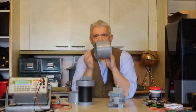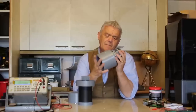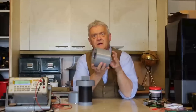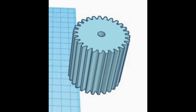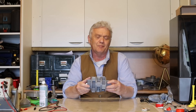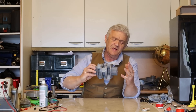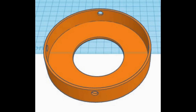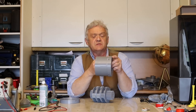The other thing we've got is the actual ring gear itself — again these are available in that file. I've done this for three of them and those three just slot in there like that. Now if I turn that I'll get 27 times the output. I've also created this large sun gear, and here it is on our gear train. The bolt goes all the way through so that's one lump, and that's because I want both an input and an output — if I input here it outputs here, but equally if I input here it will output here — so we can have it universally. I've also created this cap that goes on to the main body.